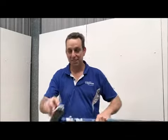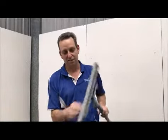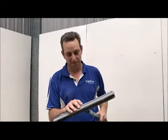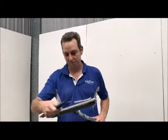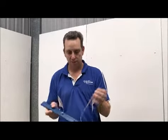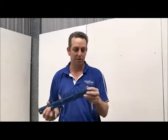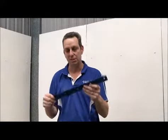So let's pull off this and see what happens. Well, the first step is good, that the actual threads aren't full of resin, so there's obviously a good enough seal, and my tape helped there. Let's crack that top off. And yes, I wouldn't expect too much problem with this type of plastic. That could be a polypropylene or something or other, so I wouldn't expect the epoxies to stick to that. The problem is normally the thermoplastic rubber.